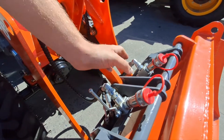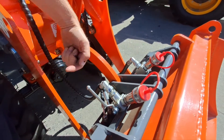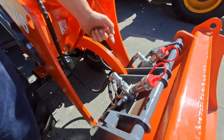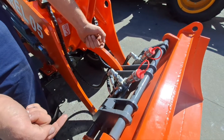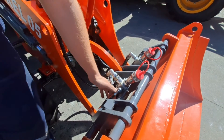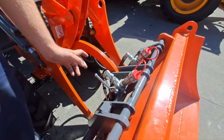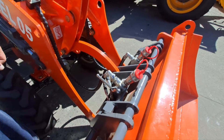If it's like this, it's going towards your external hydraulics and then your pins cannot move in. If it's like this, you can push the button there on the operators platform and then the pins go in and out. So usually it's always safe to keep it like that — that way you can't accidentally detach your attachment in the front.